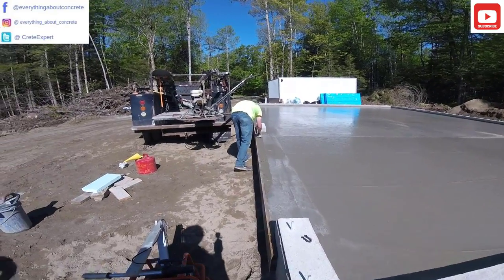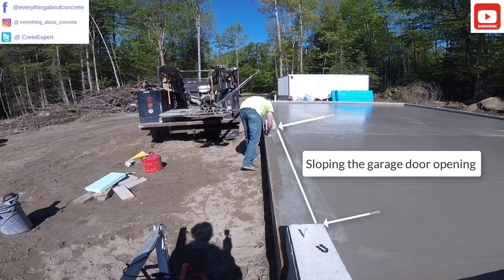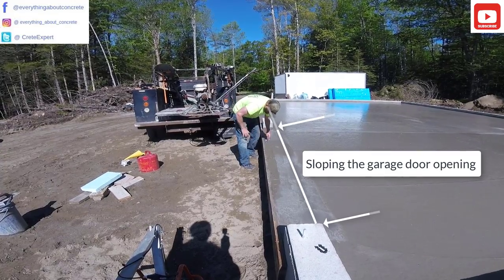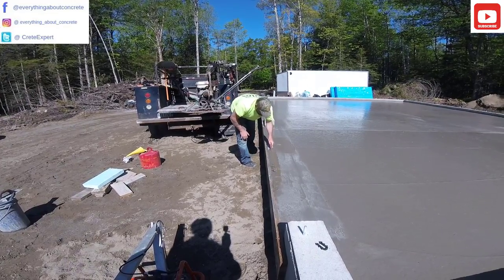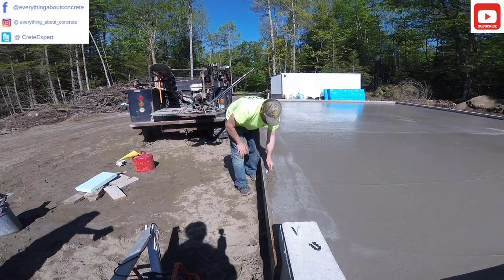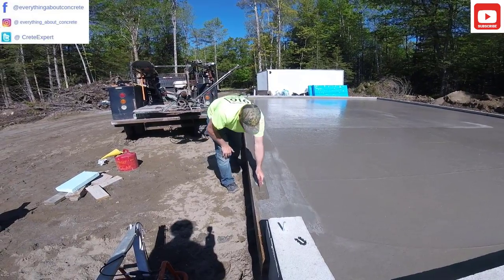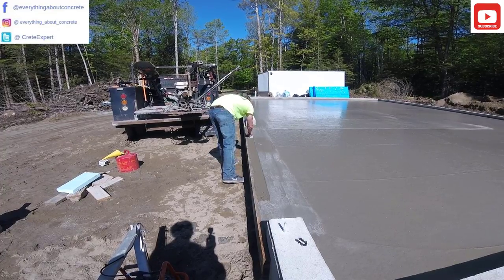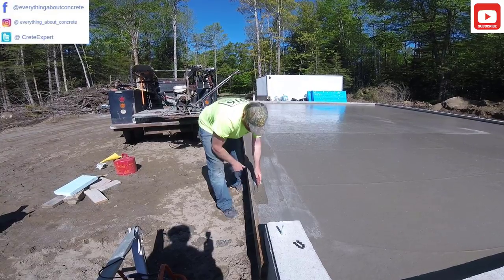This skill isn't easy to learn, but once you do learn it, it makes your garage floors just that much better. We're sloping that part right there from the inside of the concrete wall to the very outside — that's the part of the concrete floor that sits right outside the door when the garage door closes. When it rains, it hits the outside of the door and runs down. You don't want that water running underneath the door and inside the garage, you just want it to run out. If you don't taper this part, if you don't slope it out, the water is just going to run under the door.